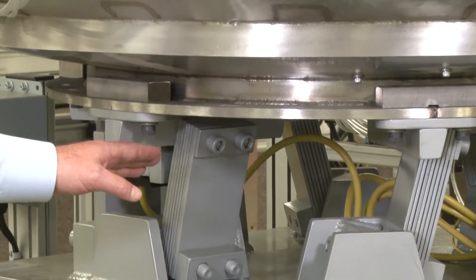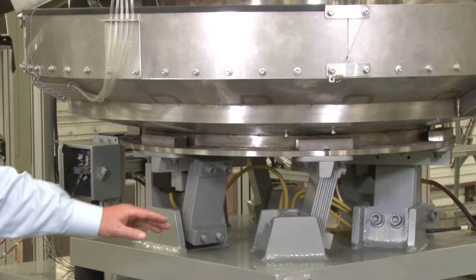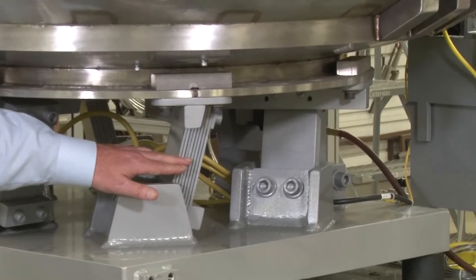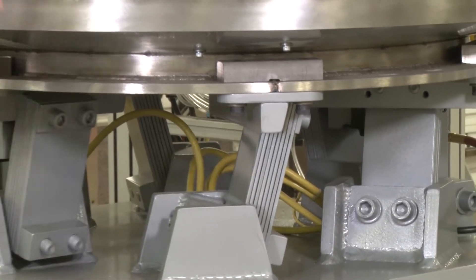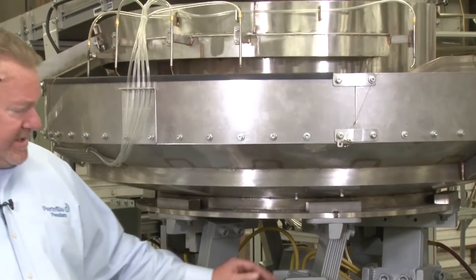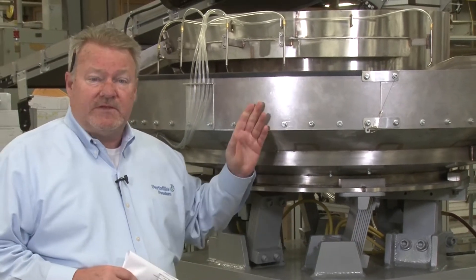You'll see the cross armless drive unit in other portions of our presentation. There are no cross arms underneath here. So if you happen to break a spring or need to replace the spring bank, it's a very simple five minute changeover versus having to replace the bowl altogether. You can very easily remove this spring bank and replace it without removing the feeder bowl itself.